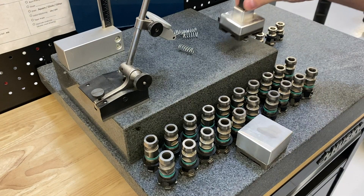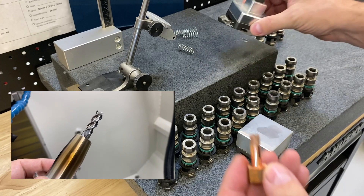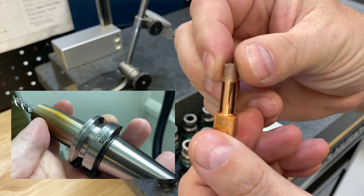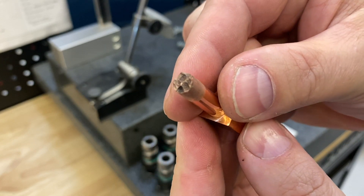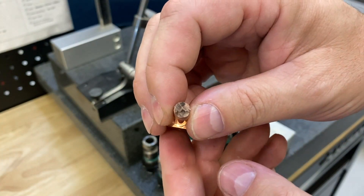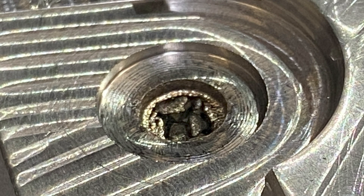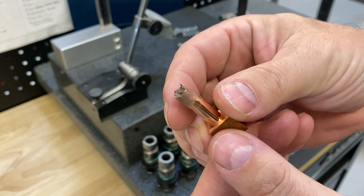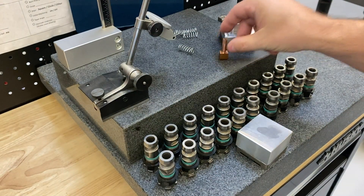This is the first time I've actually had to burn carbide out. I've had to burn high-speed steel taps out before, which is pretty easy, but carbide takes a long time. I made this little copper electrode in the same type of holder, cut on our X7 using a YG1 3/8-inch end mill — a three-flute aluminum end mill. That's right off the machine. The carbide burns at such a higher temperature than steel that in the EDM it's just super slow. Copper is much better. What I should have done is drilled a pinhole through and run flushing through the spindle. The machine doesn't do well when it's trying to calculate the logic for burning steel and carbide in the same cut.